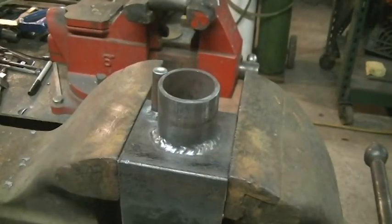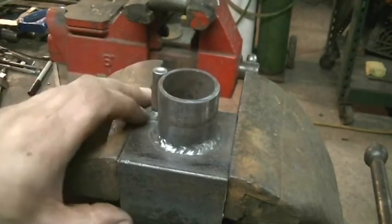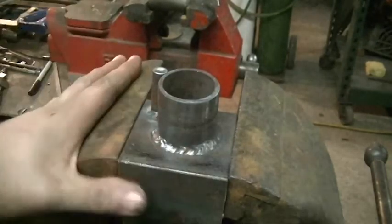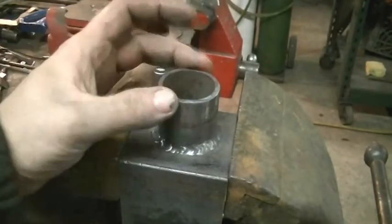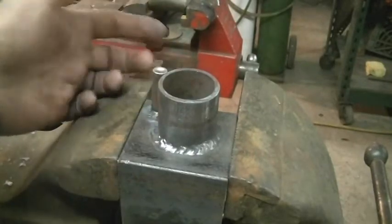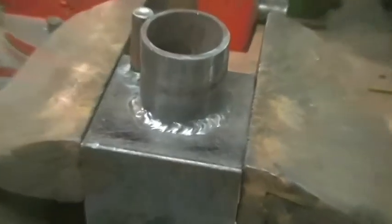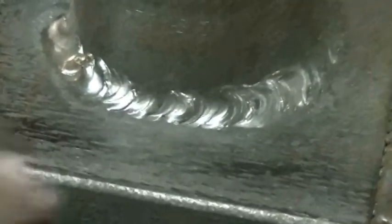So just a little information on the bending jig — this is nothing more than a piece of angle iron, and I do have it mounted in the vise sideways just for filming purposes. Normally you could just take the flat lip of the angle and put it in the vise, and it holds fine. This, I believe, was inch-and-a-half pipe, just a random piece I had laying around. And what I used for a stop is a piece of the actual material I picked up to make the hooks out of. These are really easy to throw together. You can traditionally bend S-hooks over the horn of the anvil, but I'm planning on doing a lot of them, so I made up the jig.